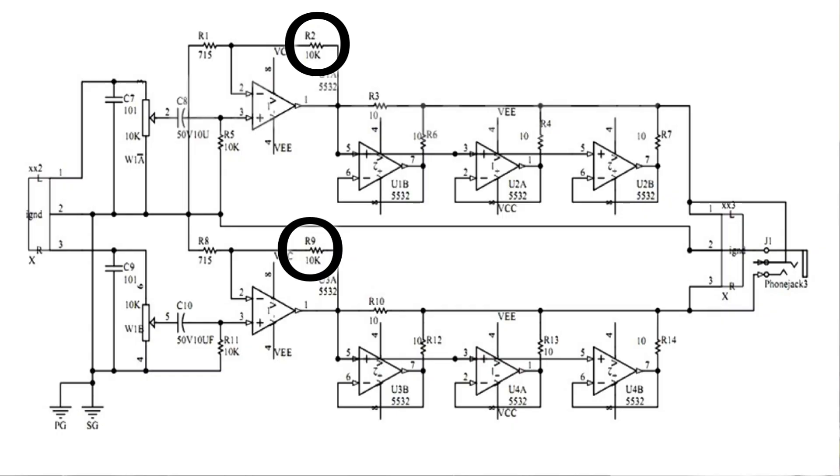I experimented with a 68 pF capacitor across resistor R2, which made it quite a bit more stable by reducing the high-frequency limit of the preamp. But when you plug in your headphones it still oscillates, so having it stable with no load connected is kind of pointless. I've removed that 68 pF capacitor because in the real world it made no difference.